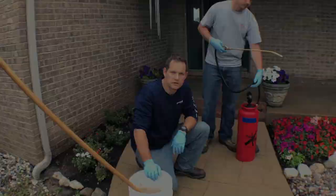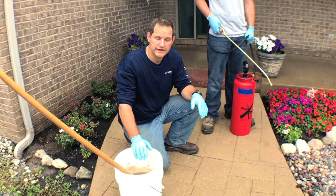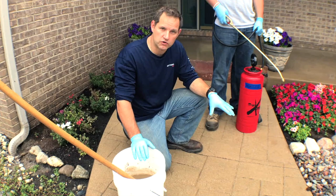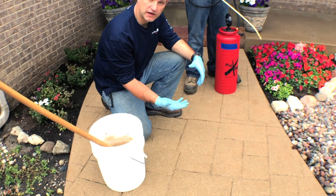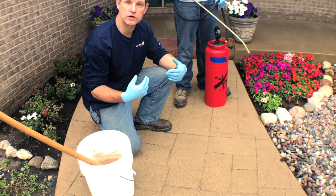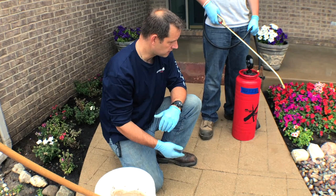On this application, we're going to brush the Permateek. It's important to take note of how saturated your concrete is with the wash water or the pre-wetting. The Permateek needs water to flow. This surface is nice and porous and holding the water, but I'm going to do a light misting ahead of time. If you're in sunlight and it's very windy, the concrete may dry out during the Permateek process, so be sure to pre-wet the concrete ahead of yourself.